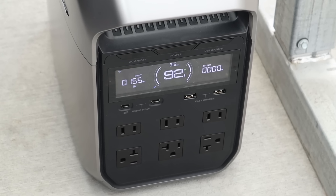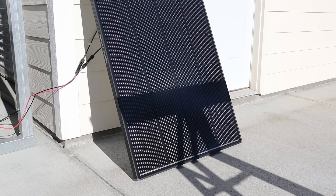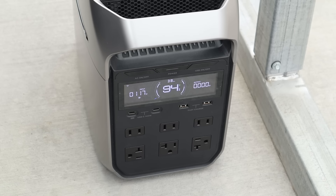That's quite the improvement over the standard 200 watt solar panel. For the final partial shading test on the Shadow Flux 200, I have a board going across the entire solar panel. Remember, on the same test for the standard panel we got under 20 watts. We are now charging at about 117 to 118 watts input — that is almost six times the amount of power compared to the standard 200 watt panel in the same test.